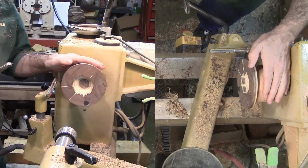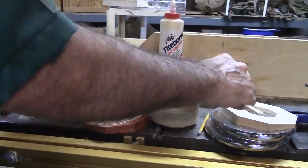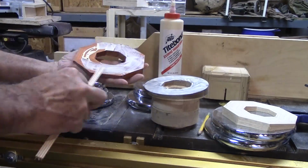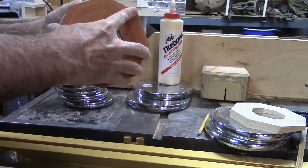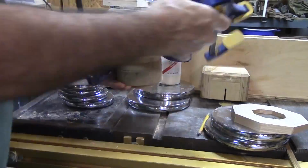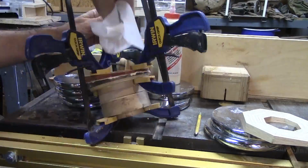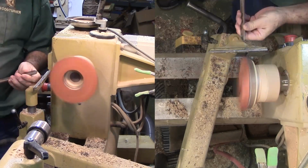But no worries. The next ring is an 8-segment ring of padauk, also on a slant. Now the clamping is getting more difficult, but I managed to get the clamps to apply enough pressure. I thought that after the last experience with the Crazy Droopy segmented bowl, one ring at a time would go easier. True, but still messy. Next, to the lathe to again trim the outer perimeter.